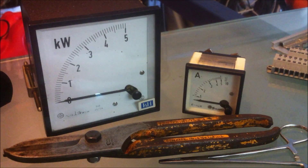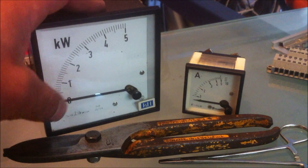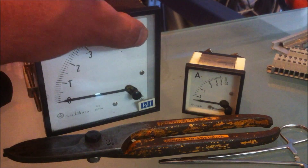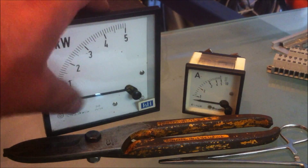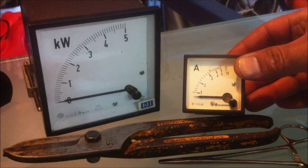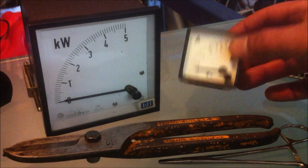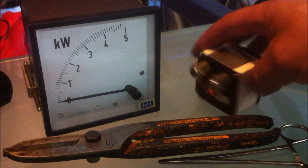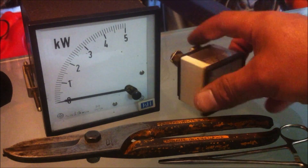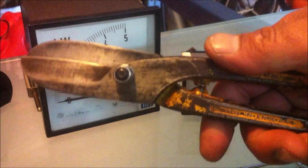That'll come in handy with the black box, but we'll use it separately — it won't be mounted in the black box because we're not having meters in there. The impulse currents I'll be working with will probably destroy the coil inside the meters, so there'll be no meters in the box. I also found a 10-amp AC meter here, and that again is internally shunted — you can tell because it's pretty heavy and has bigger terminals on the back, which is indicative of an internally shunted ammeter.